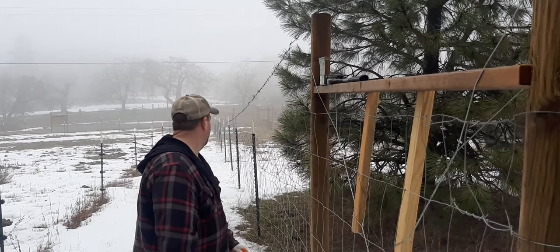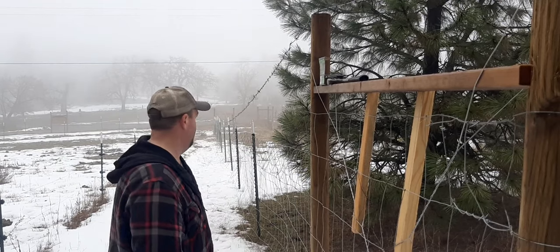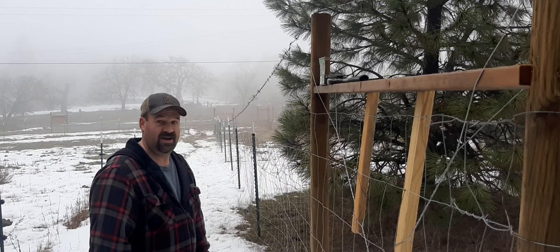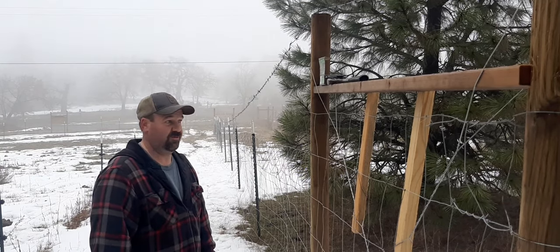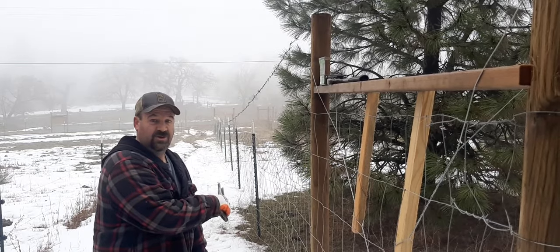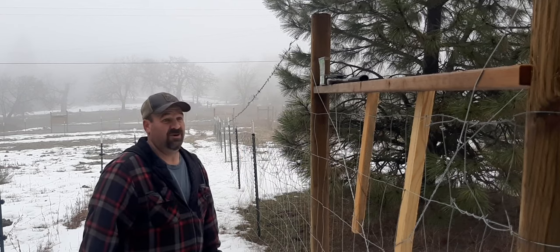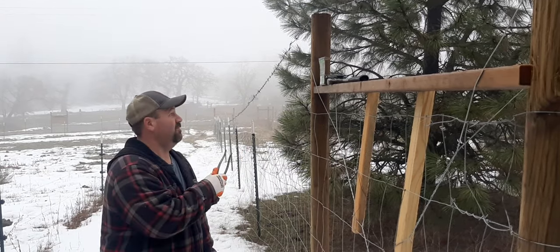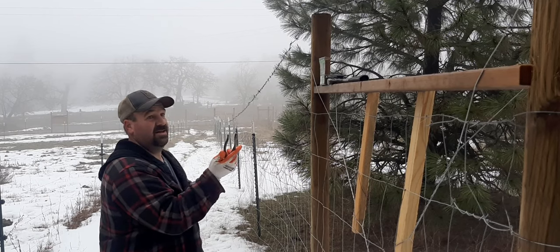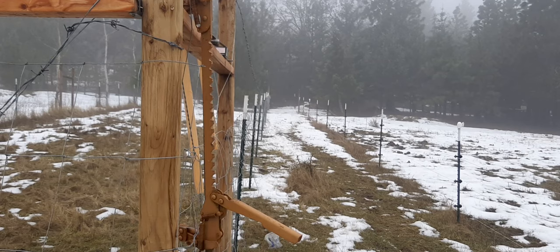I'm gonna start tightening up the fence, pulling it and getting it adjusted to take some of the slack out. I do have two good little mounds that are gonna cause the fence to kick out at the bottom, which is fine for what I'm using this for. If I was using this for cattle, I'd actually have to dig a trench so the fencing could go into the ground. You might want to know why I have my barbed wire here before I even start pulling — I use the barbed wire fence to give me my straight line for my T-posts. I usually run it first and that's how I get my T-post line.